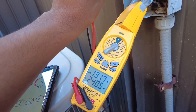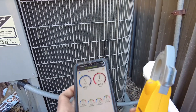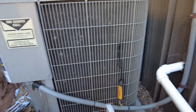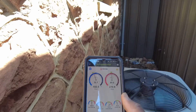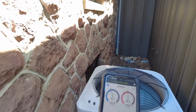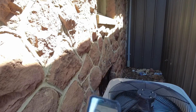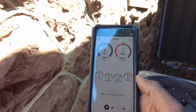Our temperatures and pressures are well locked in — I'm going to go ahead and capture those. 10 degrees, 22 degrees. This thing is running really good. Everything looks within range. It's a mismatched coil, so 13 degrees of subcooling is probably good. Take a look at the approach — right on target. Temp split: 22 degrees, looking good. It's calling for 15 degrees subcooling, so at 14.7, I'd say we're good.